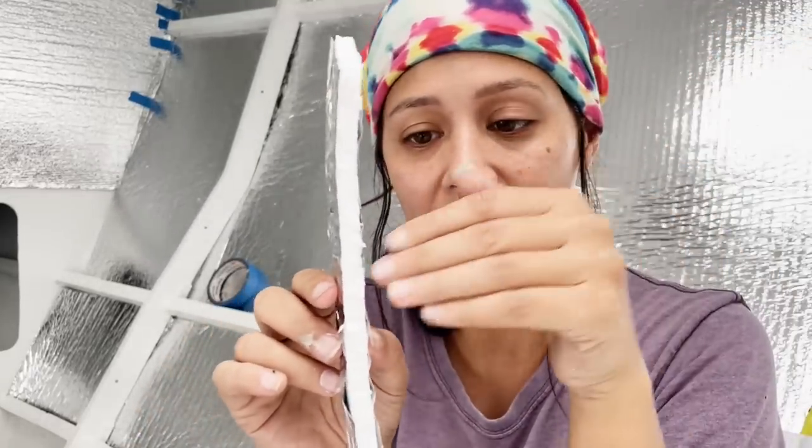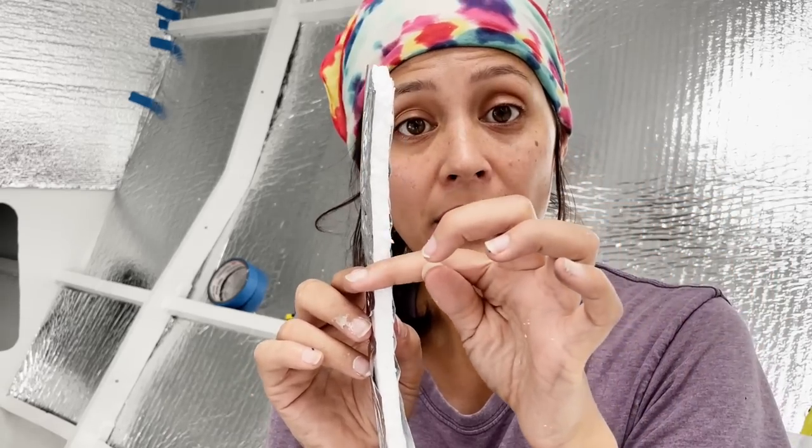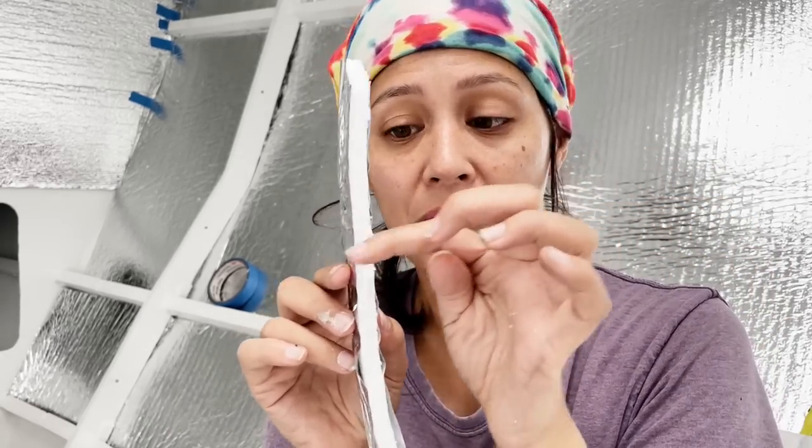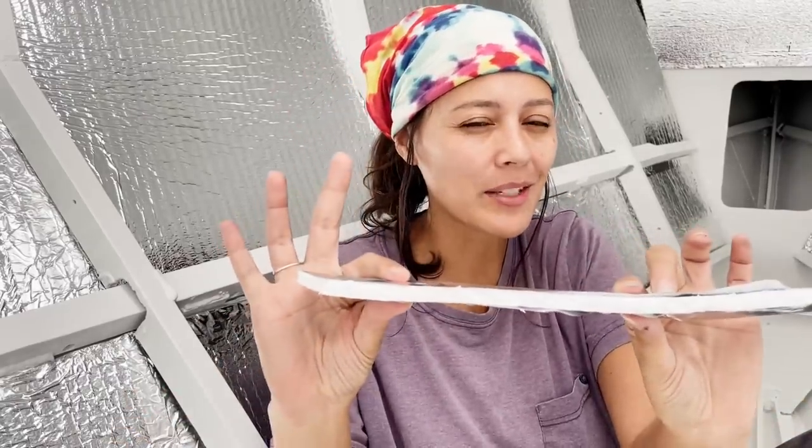The glue does separate a little bit from the mylar, but that doesn't matter because the inside is supposed to have air. The foam provides that air gap on the inside for a little separation. What happens is heat transfer enters our hull and then hits the mylar, and 93% of that heat transfer is blocked according to them. It enters into the middle into the foam, where it's trapped for a bit. And then when it tries to pass through the other layer, 93% of that residual heat transfer is blocked again. So your inside temperature is very much and dramatically affected by this tiny, very thin piece of mylar.